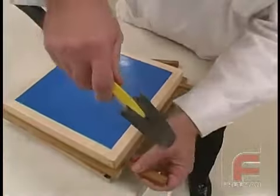Now that we have our mold, we must apply our release agents so that the parts do not stick to the mold. However, since we are pouring a urethane into a urethane, the release procedure is different than the standard two coats of wax, two coats of PVA, and one coat of wax. Here we will only apply three coats of wax, buffing after each application. For more detailed information on sealing and releasing, please see our other video on this topic.